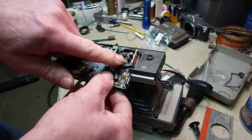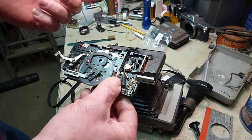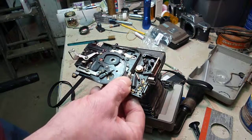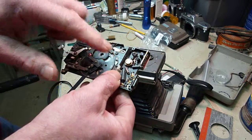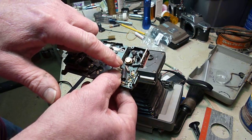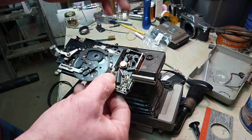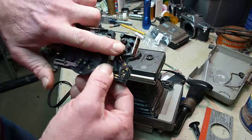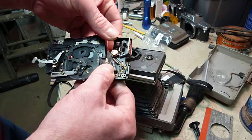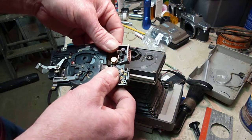Now, all I did to block out the light from getting to the sensor is I took a piece of black felt. It's a stick-on. You peel it back off, you can stick the felt to anything. I put a piece of electrical tape on the sticky side of the felt, and put it underneath the slide. You'll see it if you take it apart. Slid it underneath, on top of the photo cell, and then just kind of touch down the bits of electrical tape at the ends to hold it in place.